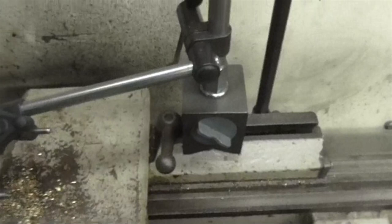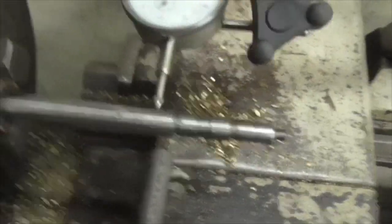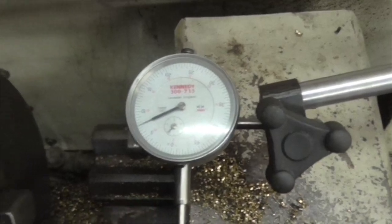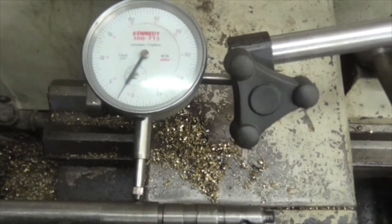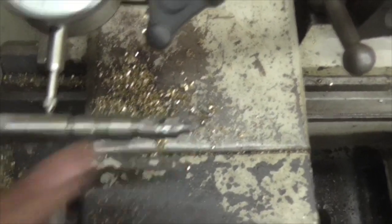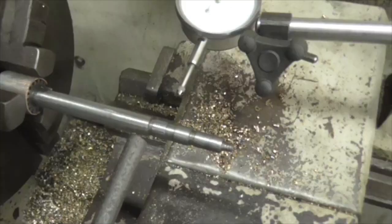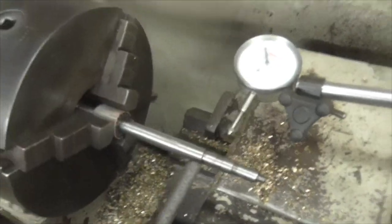Well folks, I've managed a very spindly set-up using my mega large mag base. I've given it one push with the cross slide, which pushes it very easily. Look at the difference! There's only one possibility and that's that it's moved in the chuck — it's actually just pushed the bar across. But I'm going to have another go and see if I can get it just a tiny bit straighter. That looks a huge amount straighter. Unless that's slipping in the chuck and it's not done anything at all.